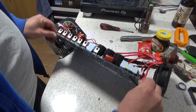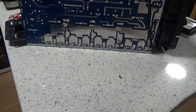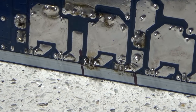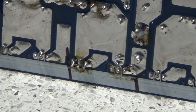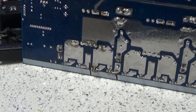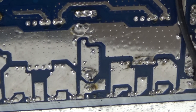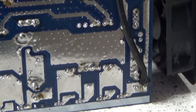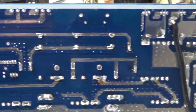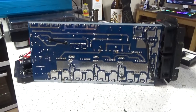Let's have a look at the bottom side of the board. Nothing's looking too bad underneath. I can't see anything more that needs to be addressed. Here's a close-up look at the section where I had to extract and put the new MOSFETs in — you can tell it's been bodged together quickly trying to get it working. Looking around the rest of the board and the bottom half, there are some dirty flux marks everywhere, but all of the big transmission wires are all looking okay. I can't see anything else on this back side of the board.